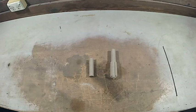But if you use different microwaves, this is where this might be a bit of a problem there. Sodium silicate is so cheap, so just make up a few cores and experiment just how long you need to cook the cores in the microwave oven, and it should work really well.